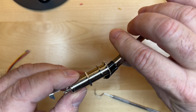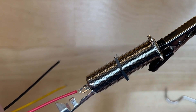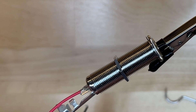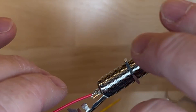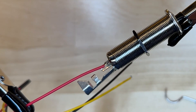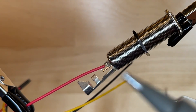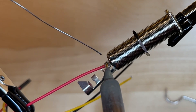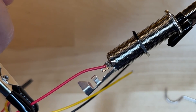With hooks in place, let's get the barrel jack out and start working on it. I'm going to take the red wire and put it on the very short pin — the tip. This is where the hook comes in handy: you can just pull it in and hook it through, and it'll hang there. Use helping hands to hold it, then crimp the lead down so it's not hanging out. To solder: clean the tip of the iron, wet it with a little solder, touch the iron on there, touch the solder, let it flow, and then remove it. That's it — we're connected.